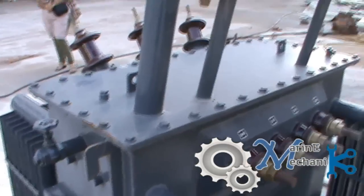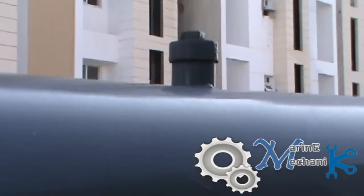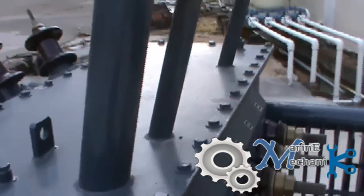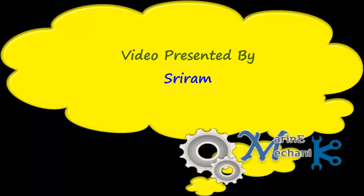The conservator tank will usually have a rubber diaphragm where half is filled with oil and the other half is with air, so that any expansion is compensated for. Here is the explosion vent from the transformer casing — if something goes wrong within, the excess pressure is relieved from it. That's it about the construction and internal details. In the next video we'll discuss about the nameplate details and the switch tapping positions in detail. Thank you for watching.